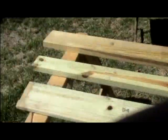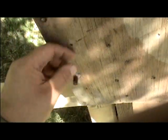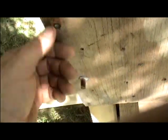The reason that I need a different saw buck for the other miter saws is because they just don't have the same footprint. I have these little threaded rod connectors sticking up off of a carriage bolt that the saw sets down on — that keeps it from moving. I'm going to do the same thing when I make this other saw buck, so I'm going to need to find a piece of plywood, which is the only thing I did not buy.